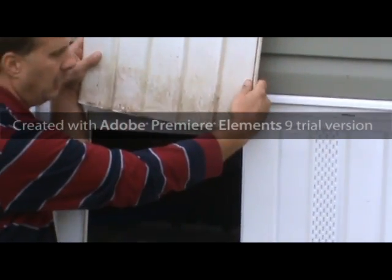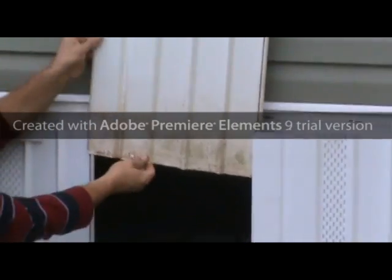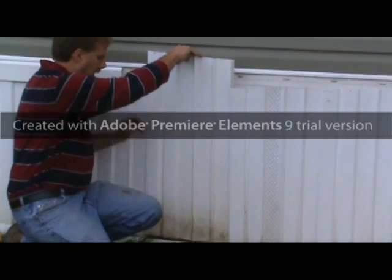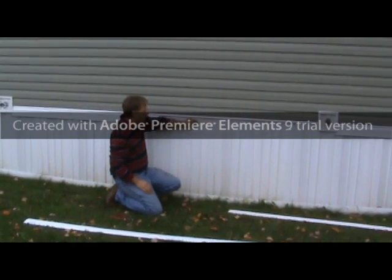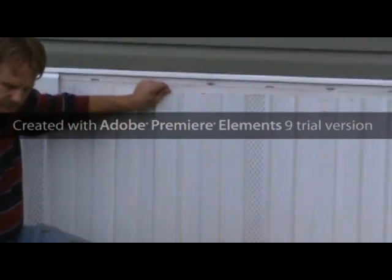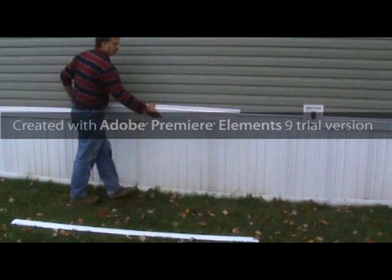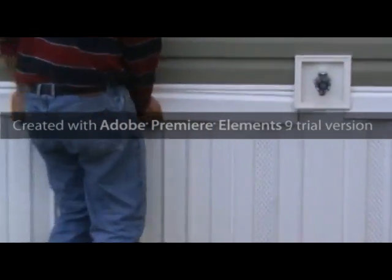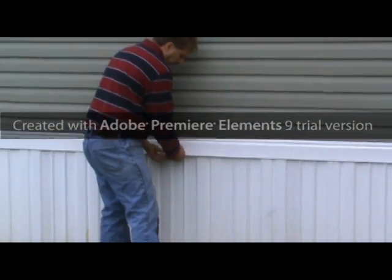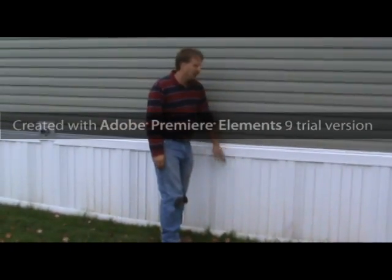The stuff installs pretty easily — just clips in place on both sides. It's a little rail system that slides down in place, allowing you to remove the skirting at any time you need to. Make sure it's down into that bottom tread. You can see where the crimp device doesn't allow it to come up, so that tells me it's been installed properly. The top rail clips right into place — start at one end, you can feel it snap in. Make sure all your overlaps are overlapped properly, and if it looks nice and neat, it's most likely installed properly. Thank you very much.